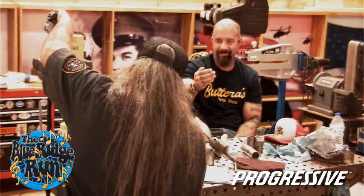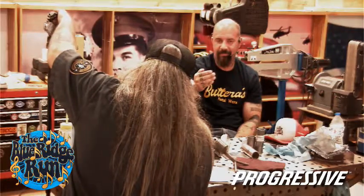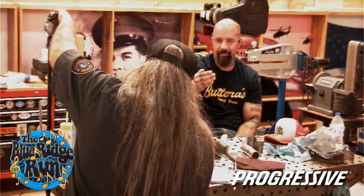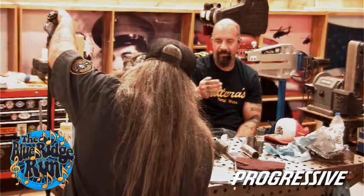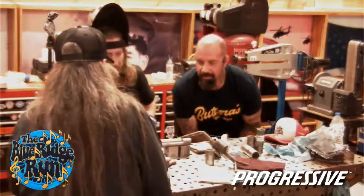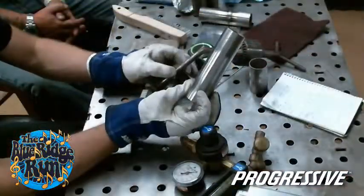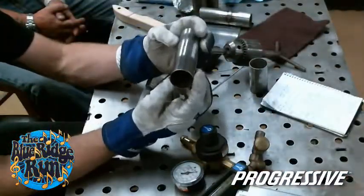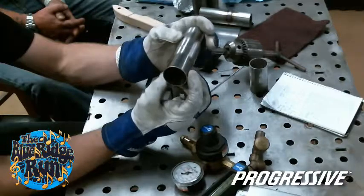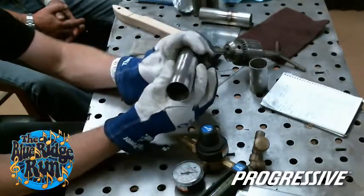So like I was saying, drop it into the seam, lift it up. I'm at like a 16th. And it just takes that split. And then so you have a nice, almost indentation that you can go back over. But you get three or four of those on something, and you don't put a lot of heat into the stainless.